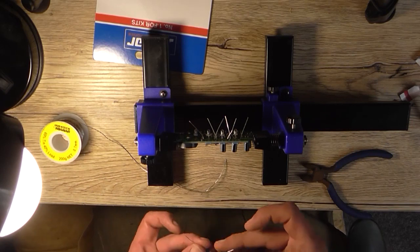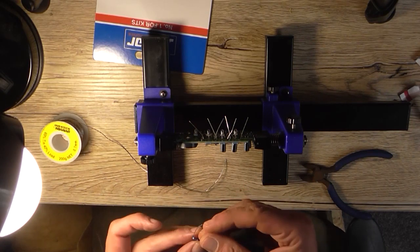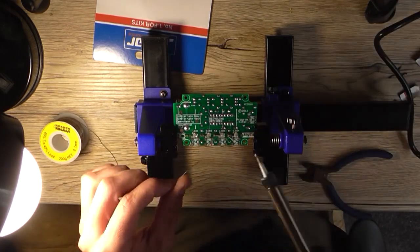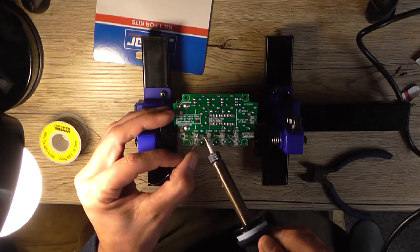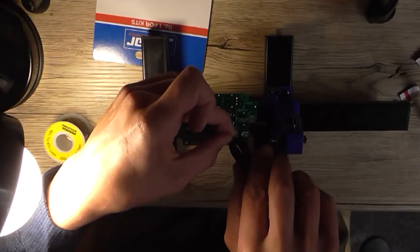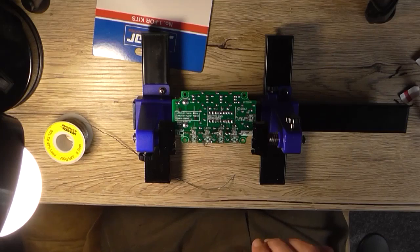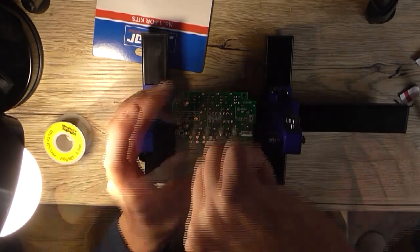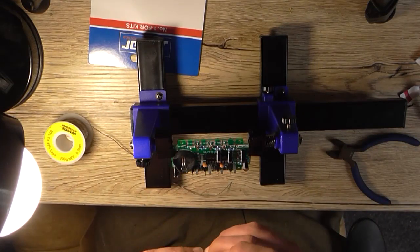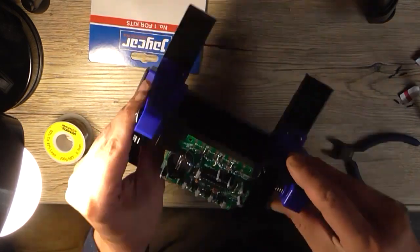And this one's going to be fun, because there's solder in the hole on this one. So I might just solder these first 3 1Ks in first. And now there's an LED in the way. Isn't that convenient? Now I need to try and get this 1K in through its hole. So I'll start one end off and turn him around again.